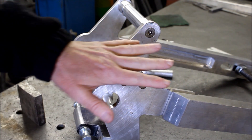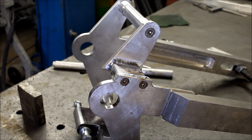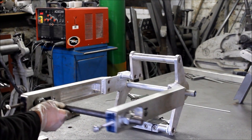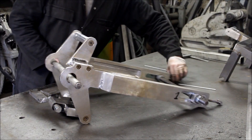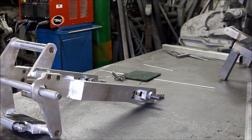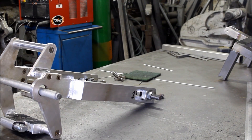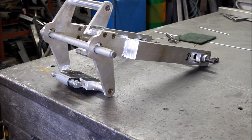The first weld is done. I won't touch it because it's very hot, but that looks very neat - no need to grind it down or touch it, I'll leave it as it is to show how it's been made. Okay Jeff, we're done. It's still aligned - thank god. We used a straight edge as a datum to make sure we were level and parallel with the wheel spindle and it still is. It's running parallel - great stuff.